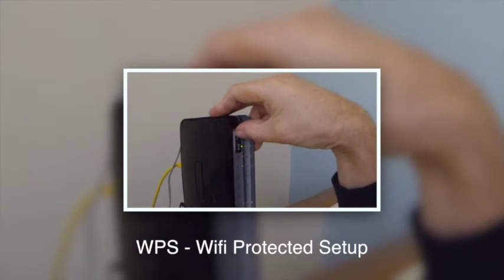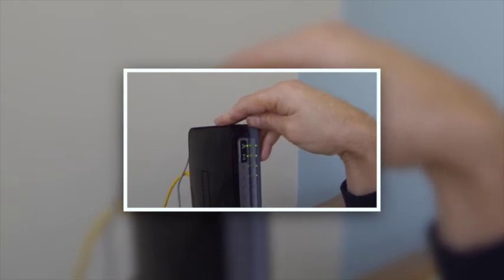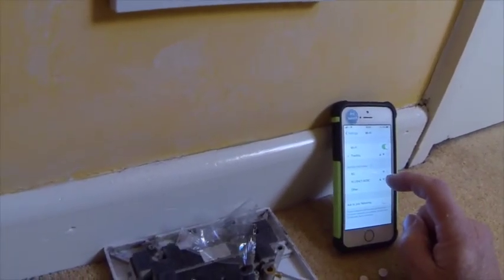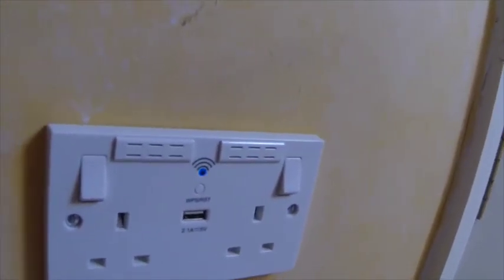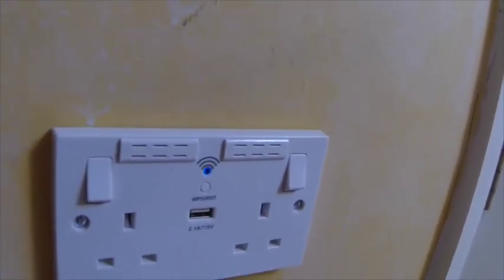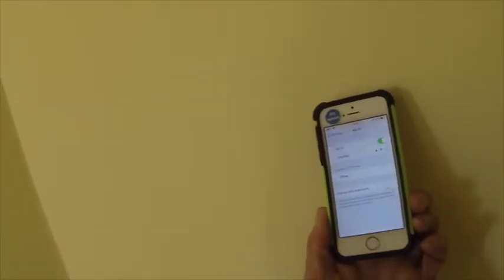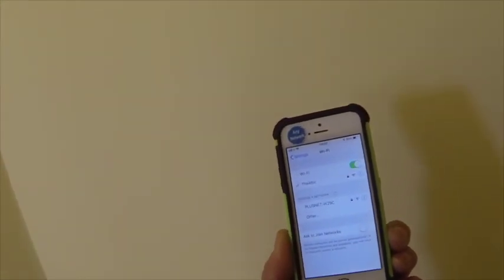Find your router and the WPS button — on mine it's at the top. I'm going to hold it down for five seconds, which should unlock the WPS. You can see it's flashing. I can see the BG network — that's my network I'm trying to connect to. Push the button once and there you go — it starts flashing orange and blue, looking to handshake with the WPS on your router. Once it goes solid blue, it's connected. Back in my dead area, I can now see my Wi-Fi has got a full five bars, which is fantastic. If you find my videos interesting, don't forget to hit the subscribe and like buttons.